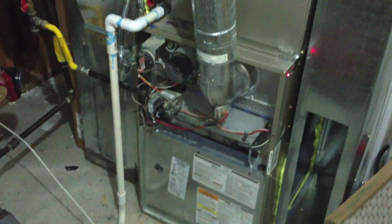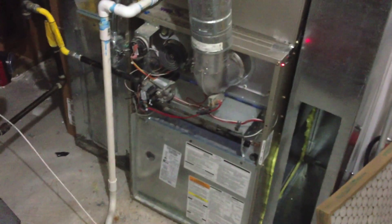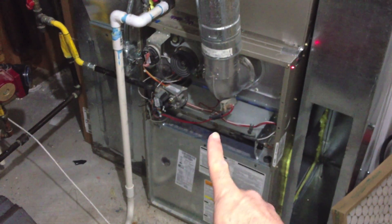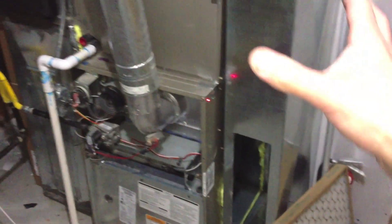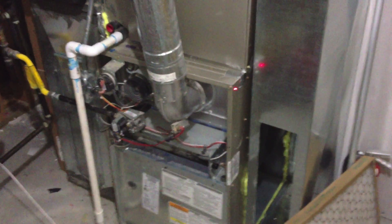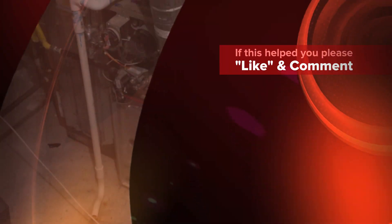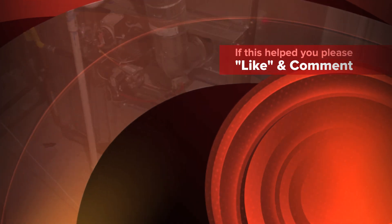This furnace — all the other things it said to check were bogus. It was just not getting enough air at all. Even with the door totally open and the filter out, it was not getting enough air to cool the blades, and the little limit switch was tripped. So if you have this furnace and you get a similar problem with this error code all the time, you might want to install — just cut open a rectangle with a jigsaw and a metal blade, put on another vent — and it's worked perfect ever since. I hope that helped. Thank you for watching — please click like and add some comments on the problems you're having too.